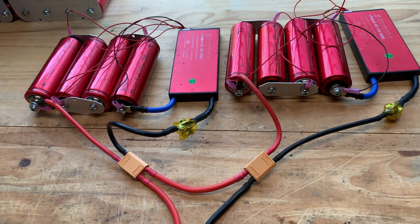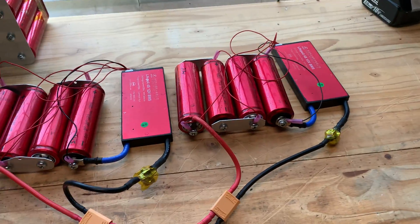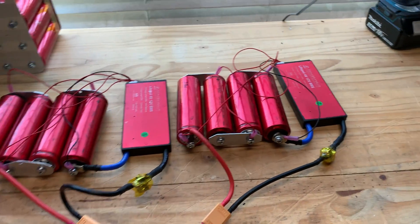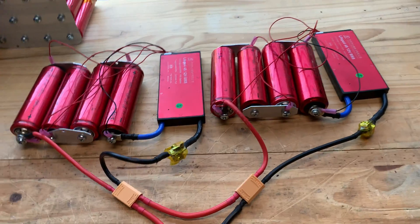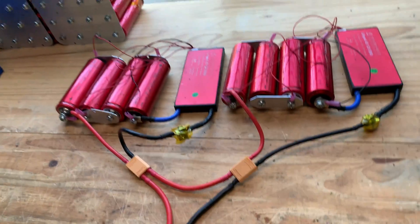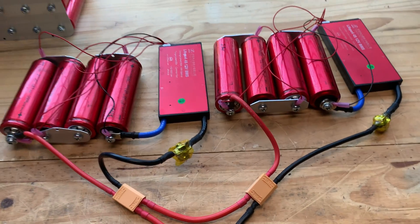So this works as 24 volts — two of these cells in series will work. Of course you can parallel them and they will work. I don't know if this changes when you put four of these — can you do 48? I'd say yes, but without having the right equipment to test it myself, take what I say with a grain of salt and actually test it yourself. But I don't see a problem.